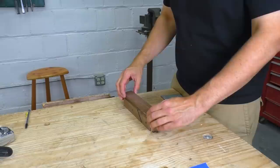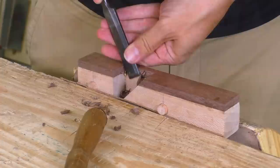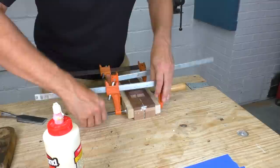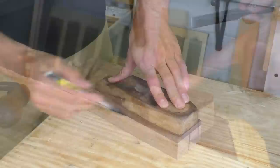The best thing is to add a bit of wood to the top of the plane. I'm using walnut so it matches that centerpiece I used, and this whole laminated construction is going to end up looking intentional instead of a total mistake. When the glue dries, I just have to trim the extra wood to match the existing throat and true up the bed again. The repair takes hours, but it's a lot better than starting from scratch. Now I'm finally ready to glue the body together. I've taped pieces of pine to the sides to spread clamping pressure and get a clean joint. I've got a couple little gaps at the corners, but I can slide some plane shavings in while the glue is still wet. After the glue is dry, I trim those off and no one will ever know.